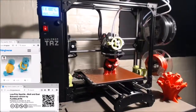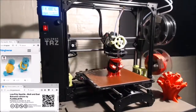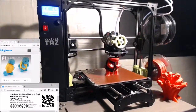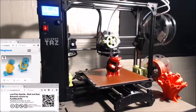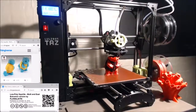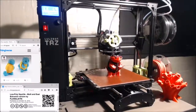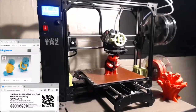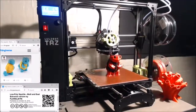Another thing you can do is turn down the temperature on the non-active extruder, but this would significantly increase print time to the point where it's probably not desirable. You have to wait for the thermostat to register at the lower temperature and also wait for the extruder to heat back up before it starts. The Squirtle took something like 18 hours, so I really don't want to double the print time to a day and a half. There's also the Ultimaker 3, a newer printer where the extruders physically retract between layers, and another printer that will actually purge the remaining plastic so that leakage isn't possible.